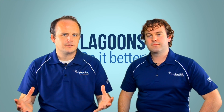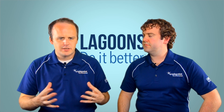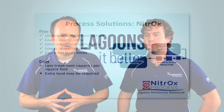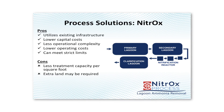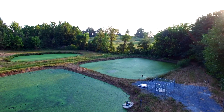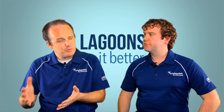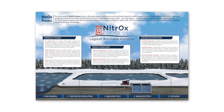At TriplePoint, when we looked at all these options and developed our Nitrox system, we thought maybe there's a way to do it better. What we do is use your first two lagoons to remove the BOD — adding aeration if needed, but if it's non-aerated and treating BOD well, we don't fix what isn't broken. We need BOD down to 30 to 40 milligrams per liter before we can nitrify. Then we pull out of the cell and go through our two-stage nitrification process.